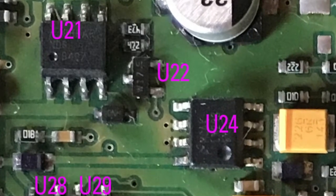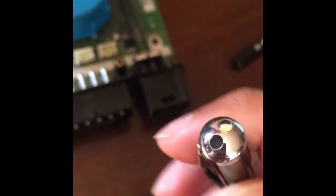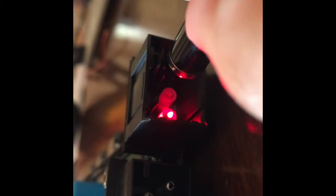Using a white LED lamp or a red laser light, illuminate the receiving fiber optic channel and verify that the transmitting fiber optic gets lit with red light. This means that the transceiver in the OSIS controller is correctly closing the fiber optic loop, and this part of the circuit is working fine.